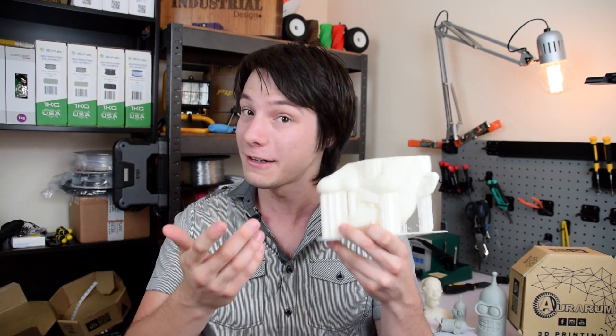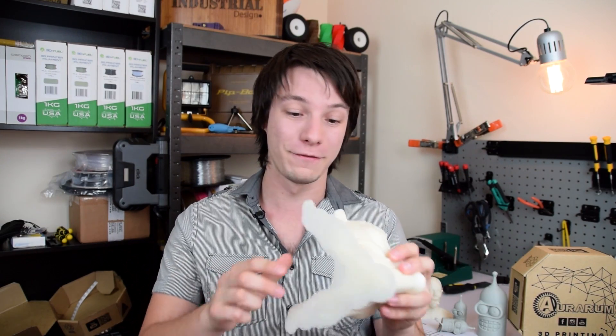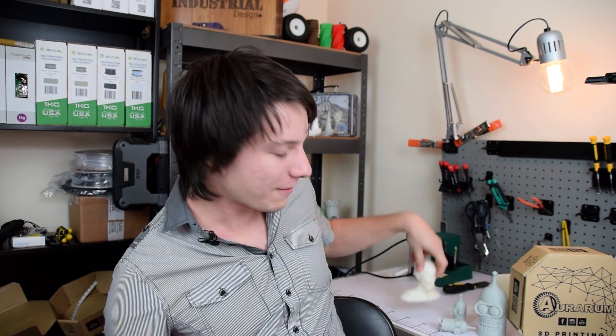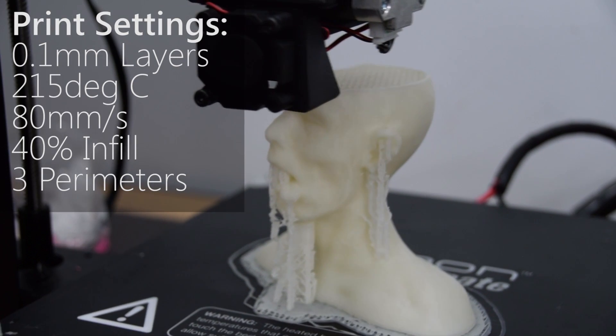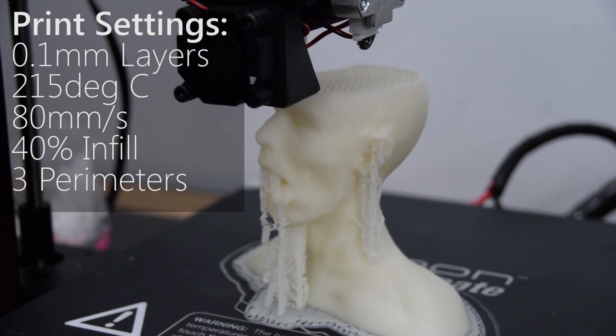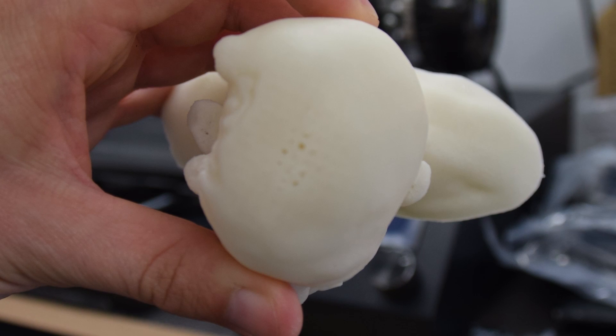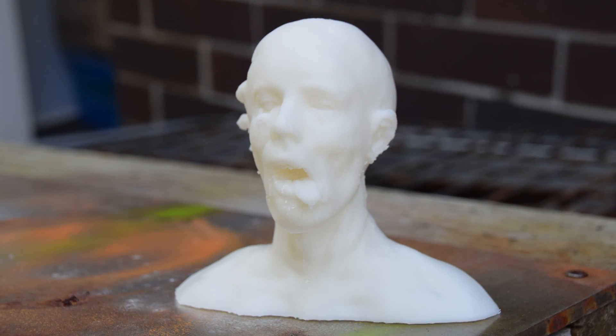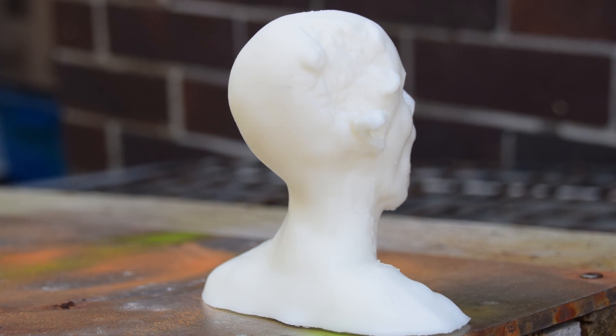It was going all day and I really tried to resist stopping it. But as you can see, the finish on this is phenomenal and the support material on PLA is perfect — look how nicely it came away. The next thing I tried was something a bit smaller so it didn't keep me up all night: a zombie head that my friends at Miles and Jules Films zombified. I did a 3D scan a while ago. This is the original scan printed at 100 micron layer height and it is awesome. There are a few tiny infill problems at the top but that was my Simplify 3D settings. The support material pulled away flawlessly.